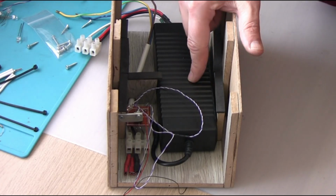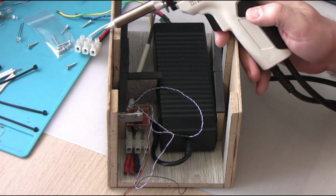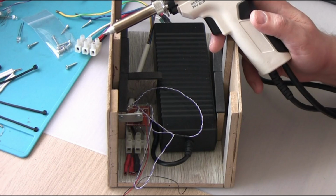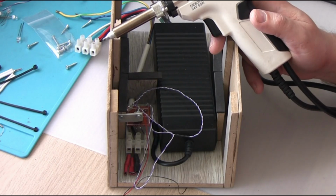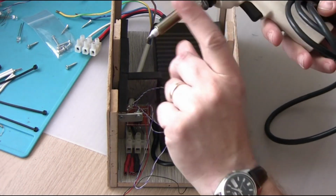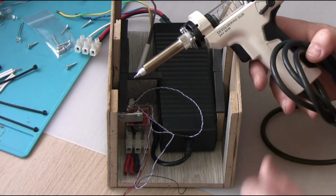This is an 18.5 volts, 6.5 amps power supply, so quite powerful. Contrary to what the description here says, 24 volts, 80 watts, it is really drawing much more current. At 16 to 18 volts it can go up to well beyond 6 amps on the cold element. Obviously as the element heats up, the resistance goes up, and then it settles around 5 or just above 5 amps. So it is approaching 80 watts for 16-18 volts.